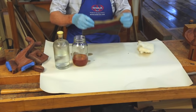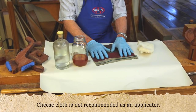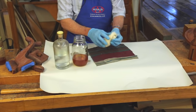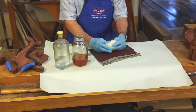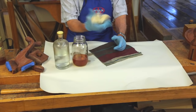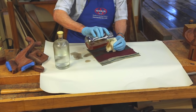I have here a piece of linen — linen is the best material for the pad. A good coarse-weave cotton will work very well too. Something like a broadcloth shirt makes a great applicator. I have here some felted sheep's wool. I'm married to a weaver and spinner, so I have lots of scraps of linen and felted sheep wool. Cotton tends to ball up into a tiny ball and doesn't have any loft, whereas sheep wool just pops right back — it holds a lot of material. We're now going to pour some of this shellac mixture into the pad and wrap it up in the linen cover.